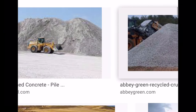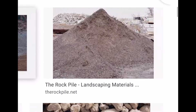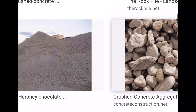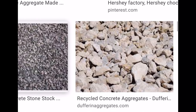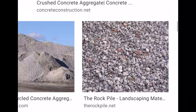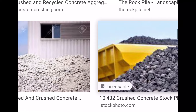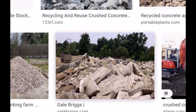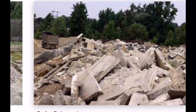This brings us to the crushed concrete method. Some benefits are that it is structurally sufficient with absolutely no worries. For example, crushed concrete is typically used as a base material under roads. It offers drainage, so spills around the hot tub or rain will drain through and will not pool on the surface and cause issues. It is not time sensitive to work with like concrete mix. It is easy to level and re-level in the future if needed. Also, it is typically reclaimed from leftover concrete, so it is environmentally beneficial since new material is not being produced to make it.